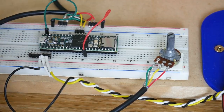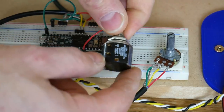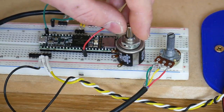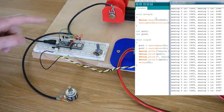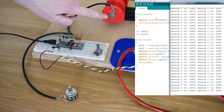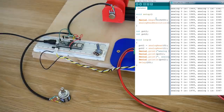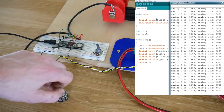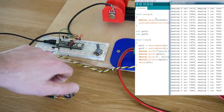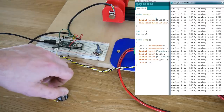I'm going to try this, which is a Vishay branded pot. It's actually a 10-turn pot that turns around 10 times, which isn't what I meant to buy, but it is wire wound. This one costs 12 pounds, so over 10 times as much. I've wired up the new pot to the Teensy analog in with the original pot still connected for comparison, and doing a serial read writing both values out to the serial terminal. We can see pretty much straight away there's just as much jitter. The more expensive pot - there's still quite a few issues there - it probably looks about the same. There is just as much jitter. But it's something we could filter out, I guess.